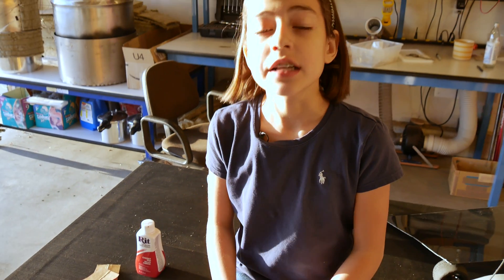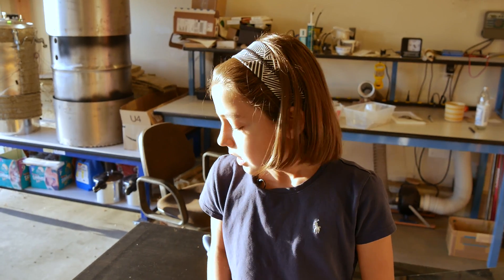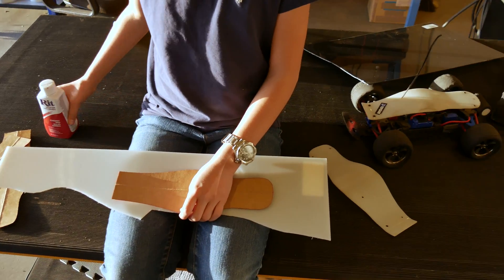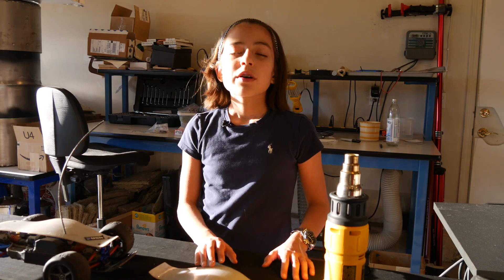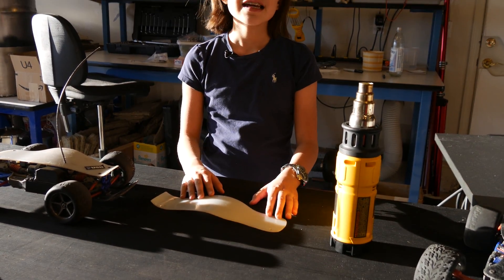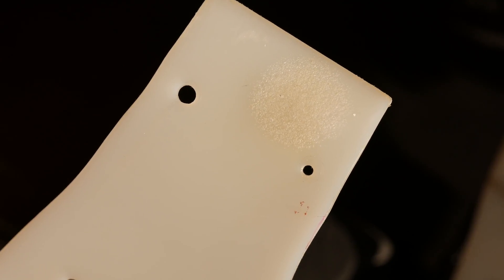It is easier to dye the nylon than the Delrin. To make it easier for the nylon to absorb the color, you should let the nylon dry for up to 12 hours at 80 degrees Celsius. That is because the nylon naturally absorbs moisture from the air, and it is easier for it to absorb the color without being moisture saturated already. When you're done with the shape and color of the body, you can bend it into the correct shape with a heat gun. Be sure not to overheat or melt the plastic. Again, it's best to let the nylon dry for 12 hours at 80 degrees Celsius, because the evaporating moisture may cause blisters on the material surface when it is heated too quickly. This is what can happen if you don't let it dry.